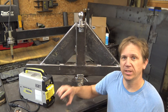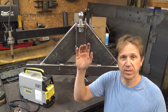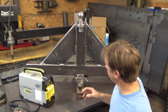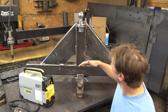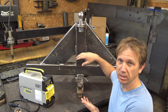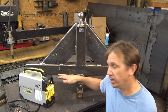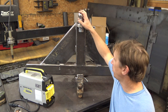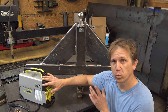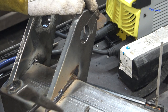After I ran a few beads on this weld pad, I decided to build something with it because that's the best way to review and test a welder. So I built this three-point trailer hitch adapter for my tractor. There's quite a bit of half-inch plate on this thing, and there's even one-inch plate up here to hold the gooseneck ball on. And this welder did really well with all of that metal. Look at that.